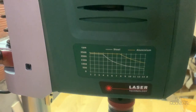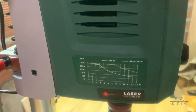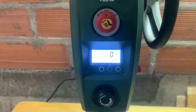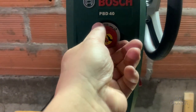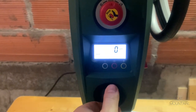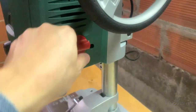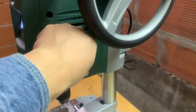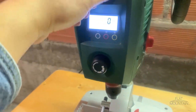There is a chart showing rotation speed versus the size of drill, so you can use that as a reference. This is how you turn it on — it shows RPM, and since it's not running it's at zero. By turning clockwise one more time it starts running, and this is how you control speed electrically. You can also select two base speeds using this lever.